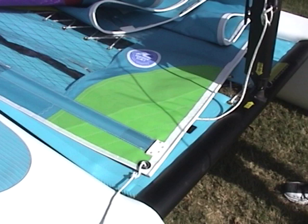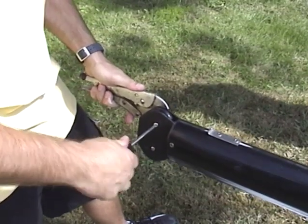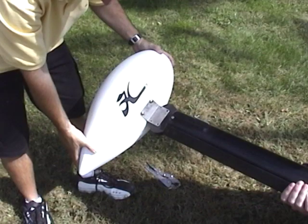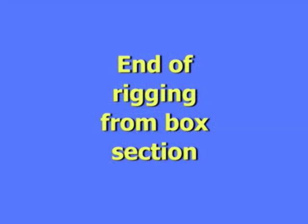There is no need to leave tension on the battens when the boat's not going to be sailed. Tie the downhaul line with a bowline to the forward lower grommet in the sail. Attach the mast float to the mast head fittings, making sure the blunt end of the float is forward on the mast. Attach the mainsheet cleating block to the rear crossbar as shown, and thread the line through the block and the upper block with the hook as shown. You're now finished with the initial assembly.